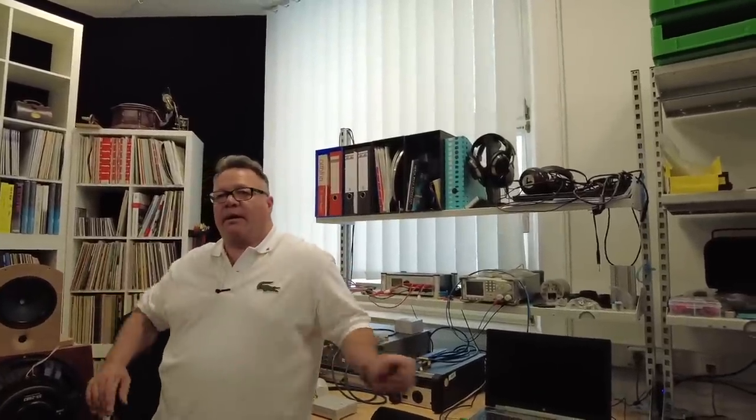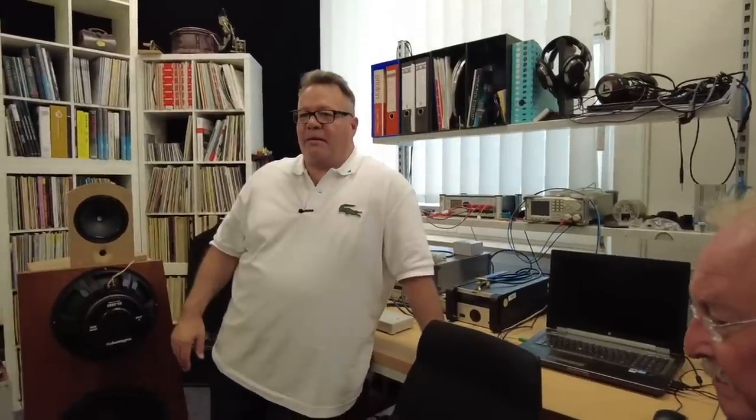And who manufactures your belts? We have our own molding, and we manufacture them by ourselves. We have made our own moldings, an injection mold company is producing it for us. We're not producing it in-house, but we have our own moldings, which was a stupid idea in the beginning because it's very cost-intensive. But on the other side, you can work on different material mixes. We usually have a higher amount of silicone in the belt, which is not easy to manage because you have to make the right mixture, which is of course proprietary. We have certain knowledge over the years where you don't need a patent because it's like Coca-Cola. You have the recipe in the safe, and there it stays, and nobody will see it.